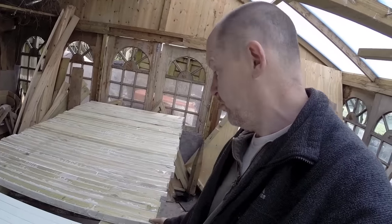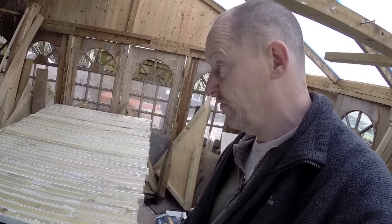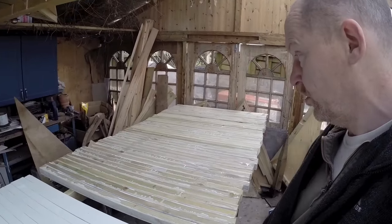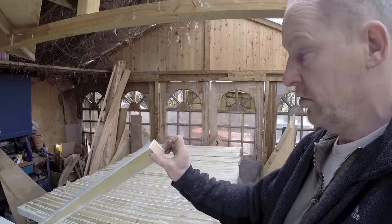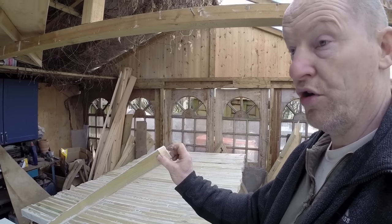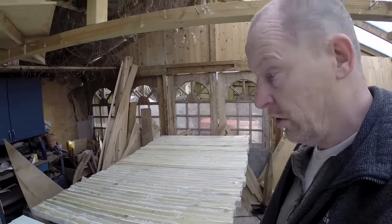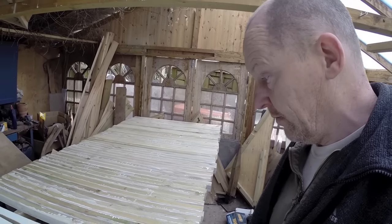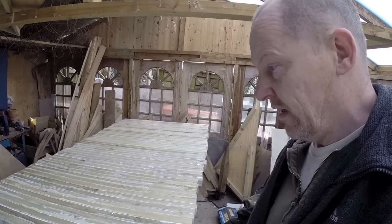When I'm painting a dome, which is not that often to be honest, you're basically painting hundreds and hundreds of bits of wood. I like to set them out like this and just paint the whole lot one coat. This is before I do any machining. This is going to be cut down the centre, but the centre piece that's cut with no paint on it is joined to the next triangle, so it doesn't need painting. So I prefer to paint at least one coat now before I even start machining, because I've tried painting triangles one at a time and it's horrible.